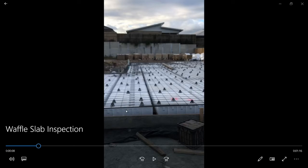You can also see a few other interesting things in this shot. Around the outside edge there's an extra heavy bar — much bigger or thicker than all the rest of the bars in the middle. This is some crack control around the edge of the slab. These things are bar chairs; they keep the mesh up off the slab. The timber in the front is the formwork — that's the side of the concrete. When the concrete gets poured and this timber gets removed, that'll be the outside edge of the concrete.